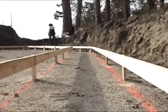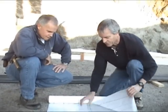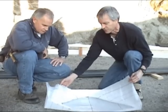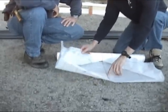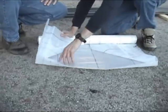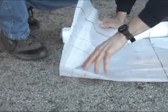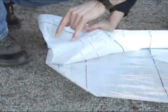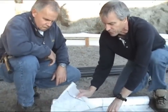We're ready for fabric. Here we have the Fastfoot fabric and you can see it's C-folded, which allows you to put it between your stakes and your screed boards. There are three sets of lines: you've got your center line — this black line — then you've got four lines which allow you to do different widths of footing, and then lines on the edge, called edge lines, which allow you to align it along the screed board so you don't have to bend down all the time.